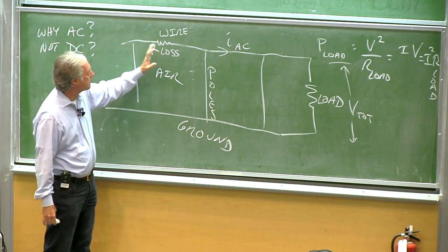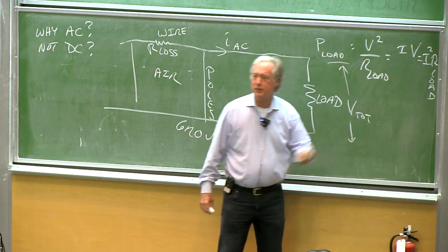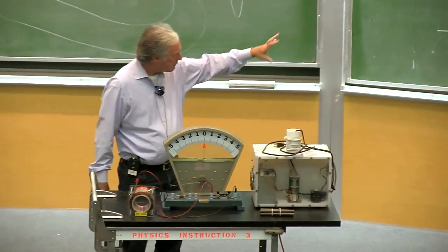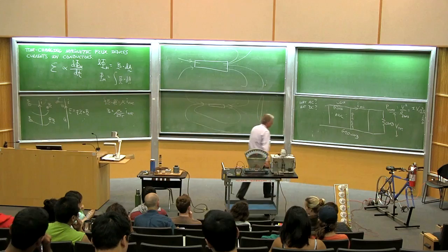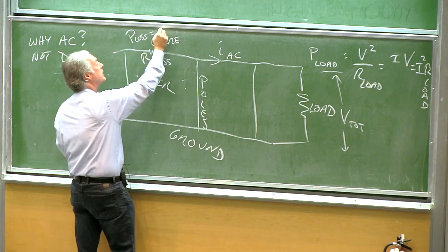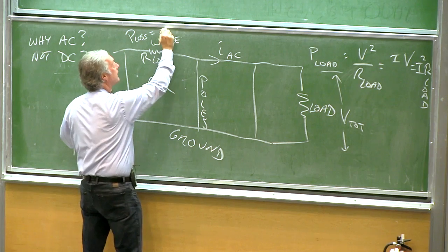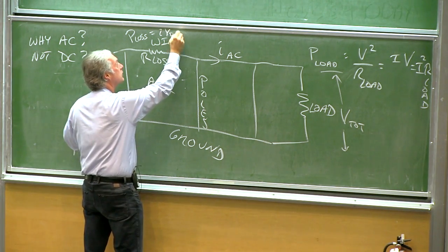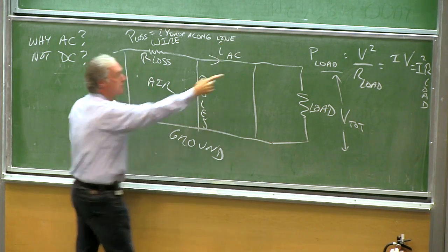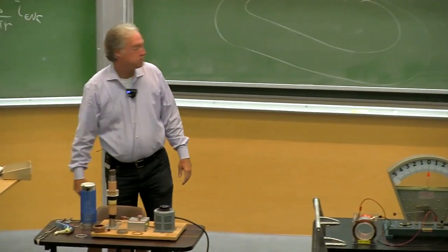Okay, so I just wanted to make sure, because last time I was thinking after the lecture, oh, we had this thing sitting up here, and if anybody thought about the little resistance, they'd go, oh, that doesn't make sense. Well, it does, but you have to let the physics guide your thoughts. So you could think here about, maybe you want to think the power loss here is going to be the current that's going down the line. That's the number of charge carriers per second that are going along. And then they're going to have a little bit of a drop voltage along the line. So it's the same kind of Joule loss and Joule equations, but it's not the same voltage that's acting. Okay?